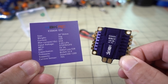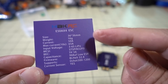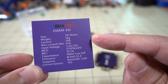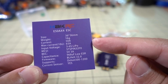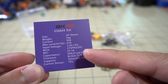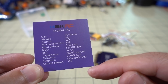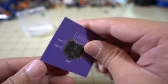It's got a really nice heatsink here on top — I think it's aluminum. Going over the specs: it's 36x36mm board size with a 30x30 mounting style, 16 grams, 50 amps continuous and 65 amps burst, 3-6S LiPo, a 5-volt 3-amp voltage regulator, and it comes with a 960 microfarad low ESR capacitor. It supports up to DSHOT 1200 and includes a current sensor.